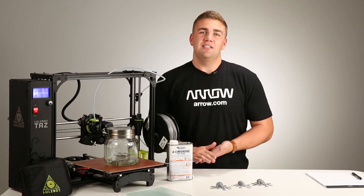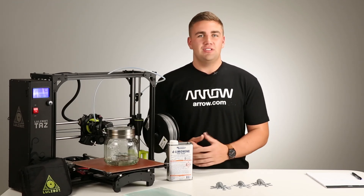Just a quick recap — and these are just suggestions, so if you find better methodology feel free to let us know. We recommend heating your bed up to about 120 degrees. Get a nice big glass or metal jar — we like glass because we can see into it without removing the lid. Set up some sort of observation deck for your part; don't actually put it in the liquid or you'll completely dissolve it. We recommend using limonene and HIPS rather than acetone and ABS. If you have a ton of acetone laying around, knock yourselves out — but don't. Please subscribe to our page and we'll be doing a lot more content like this. See you next time.